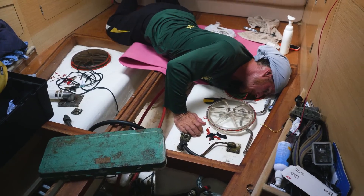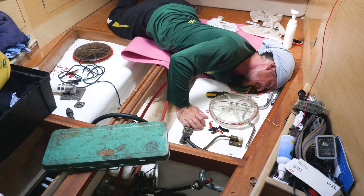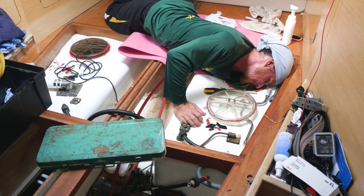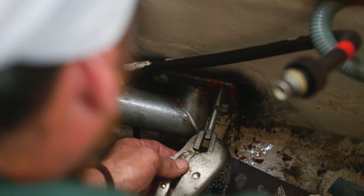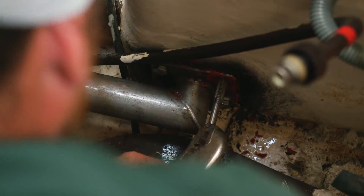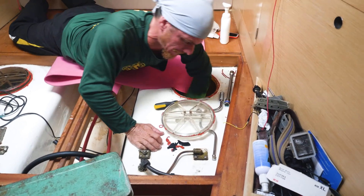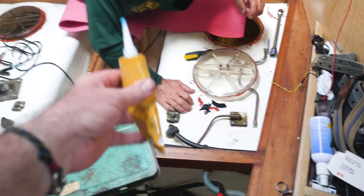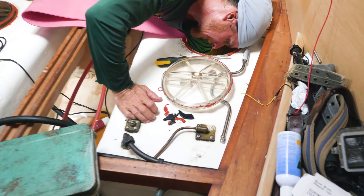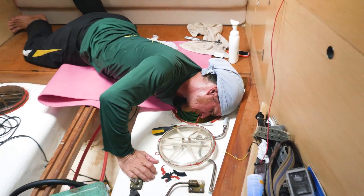Ricky has taken Liz's job — Liz has been relegated, actually sacked — because we believe the leak is possibly due to a loose nut on the inside of the tank. Ricky has very kindly re-tapped that leaking hole, going up from a size 10 bolt to a size 12, and we're just putting them back in with that gasket sealant Liz brought back from the UK. We're putting a dab on the bolts as they go through and making sure the nuts are done up properly this time.